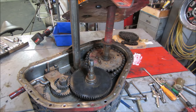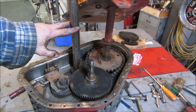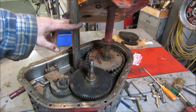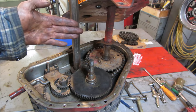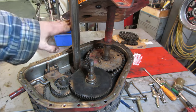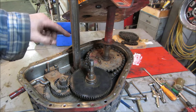And I did get it all back together. Well, all inside right now. No parts left over. I'll do a quick little rundown of how it works. So this is the shaft that the disc, that rubber disc under the trans, slides forward and back. It has the five speeds in reverse. And on the tractor, there's that metal plate. So it has a metal plate hitting a rubber disc here, driving it. And where you move that disc faster or slower is the speed going into this gearbox.